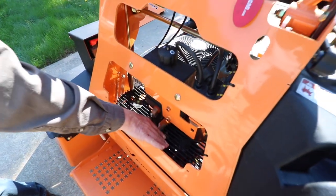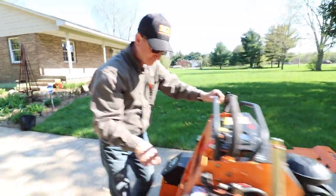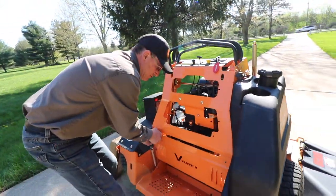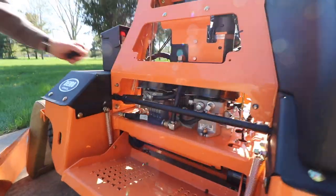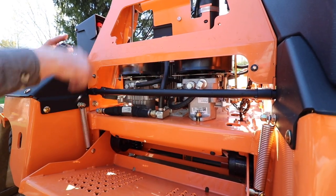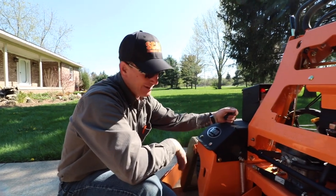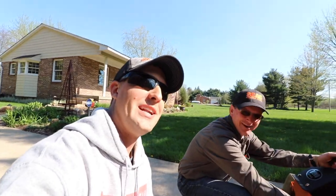Because we've got the fans now, we were able to get rid of the hydro cooler, which was a little tough to get at. Also back here for serviceability — no tools. If you need to get to your dump valves, they're right here. Just crack them and it'll relieve your pressure out of the hydros so you can freewheel it. That's beautiful — I just got my lawnmower stuck and forgot to release my hydros in the mud.